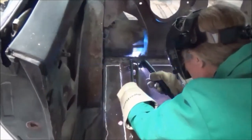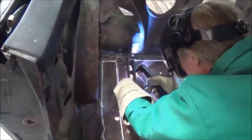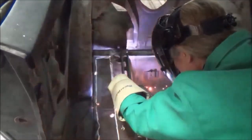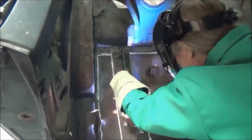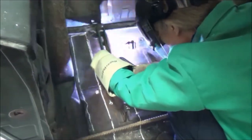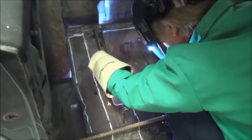This makes it easy to cleanly cut across rusty metal panels. Here I am using the PowerMax 45 to cut around the frame rails on the old floor pan of the Firebird. I'm using a piece of metal and running my PowerMax torch along it, giving me a nice, clean line cutting around these.